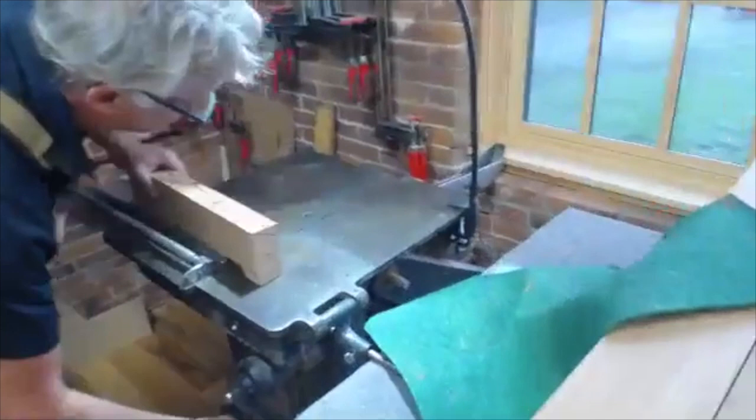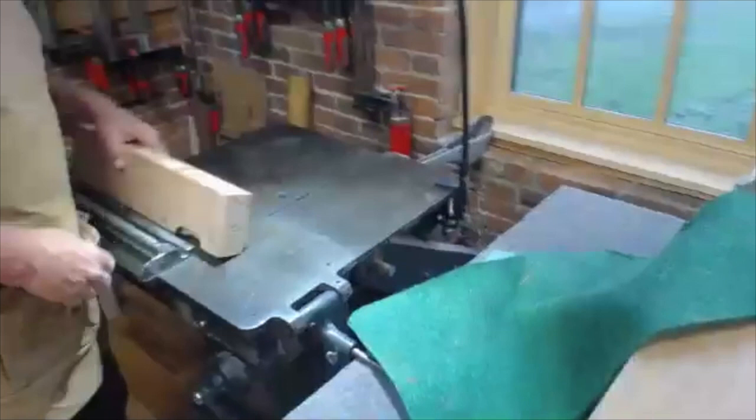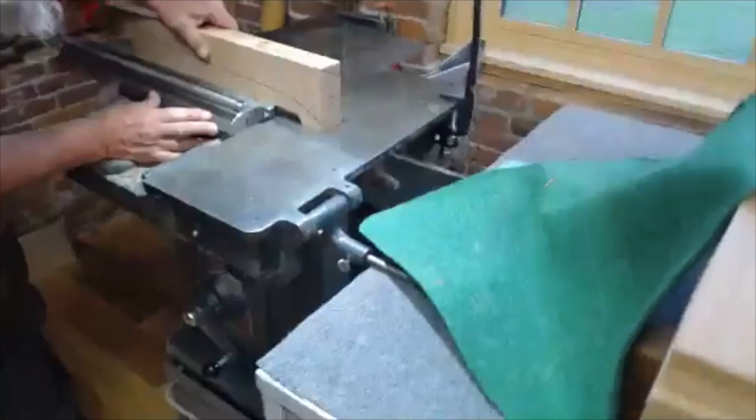So I'll measure this 1/4 inch. I think it's a 1/4 inch cut. I get a test block, I test it, and it's 1/4 inch. And then, let's try this angle here. So imagine that this round over, this slot here, is not there, but I cut that dado. I cut this side on my knife wall.